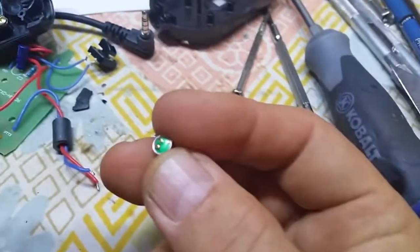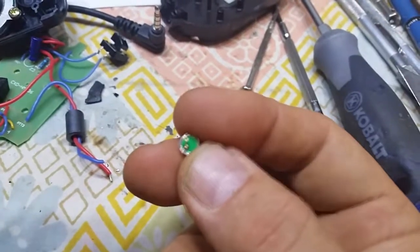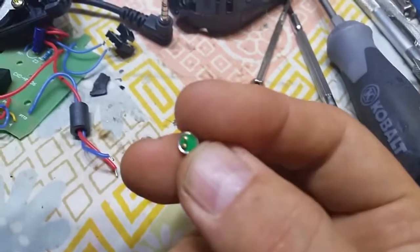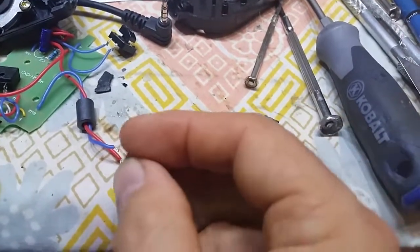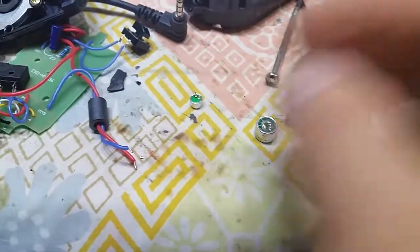The new one, you can tell, has a plus and minus on it because one of the leads on the thing is surrounded with a little bit of insulation or a black piece of circuit board. The other one, the upper one, is the ground one. So I'm going to pre-tin those 2 little legs on there. Just add a touch of solder to them first to make the wires solder on more easily, and then I'm just going to tack solder those wires on.